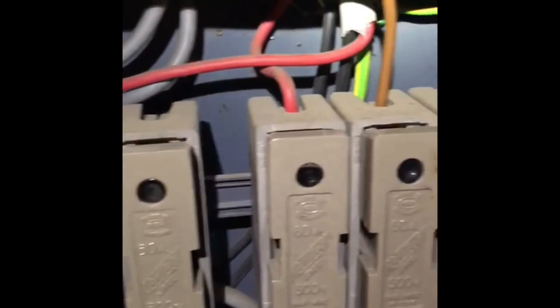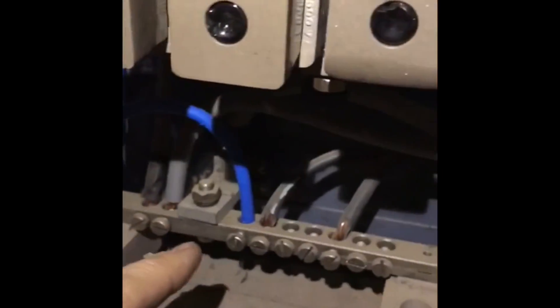It looks like this is the armoured cable, so the armoured cable comes through here and goes all the way through to the board we've just been to. The armour hasn't been used as an earth. The neutral comes down there - that's okay. The line conductor comes into phase three - that's okay. If we follow the earth around, that is the earth connection there. When it's in place it probably does read okay because this screw goes into this terminal.